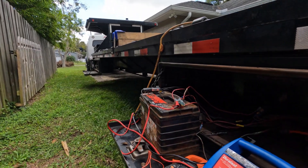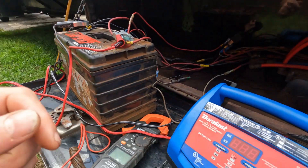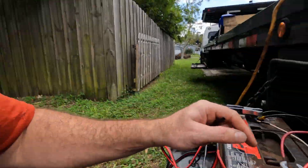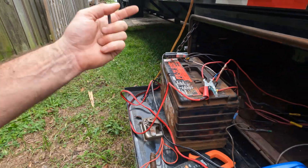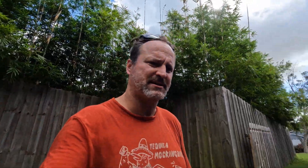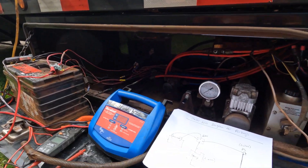Sorry, people. This is the mess I've been trying to figure out. The battery was charging — hooked up all night, said it was full — but I only have 7 volts. I have it reattached right to the top posts, hopefully it will charge. If not, that battery is already toast. I think a sealed lead acid battery is the only way to go inside these trailers because it's so rough — hence all the corrosion in here. This has been a really trying three weeks, to say the least.